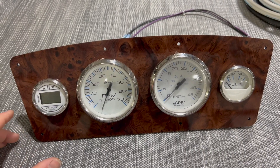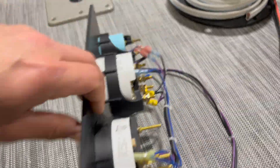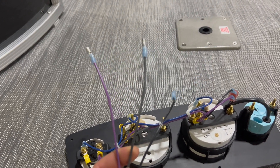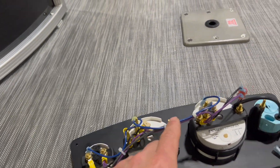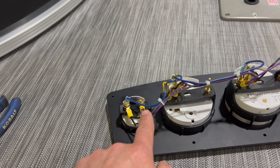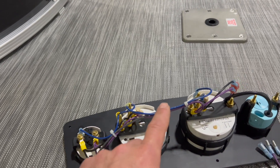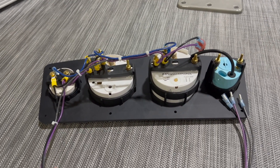This is one of the gauge packages from pontoonstuff.com, but whichever one you order, they're going to look similar on the back side — they're already wired for you. You have three wires: purple is key-on power, black is ground, and gray is the tach sender. The tach sender signal goes all the way to the tach. Your purple key-on power comes into one of the gauges and then piggybacks across — same thing with your ground. That blue wire I was talking about just powers the light bulbs in the backs of the gauges. Very straightforward and simple to tap into your existing harness.